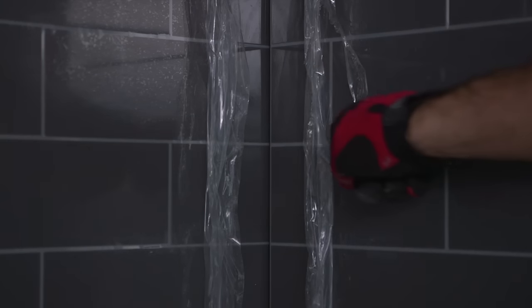After installing the side wall, verify that the grout lines are in line with the ones on the back wall. Verify that the side wall and back wall fit snugly together as shown. There should be no large gap between them. If there is, this could mean that the side wall retraction pins aren't fully engaged in the back wall X fasteners. Hold the wall in place.